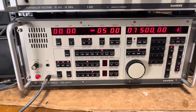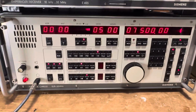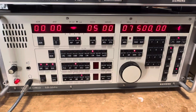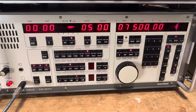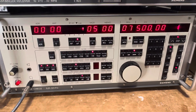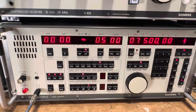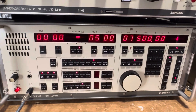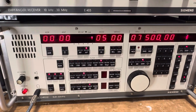The interesting thing about this that separates it from the earlier versions — the 531s and 530s — is that this radio has two power supplies. If you're doing a power conversion, you have to do one for the main power supply, which powers the whole machine, and an additional one to run the electronic interface you see here. That's a little bit of a different wrinkle. My documentation is 531 stuff, which doesn't have the front panel or any of the functions really there.